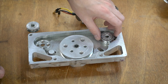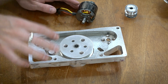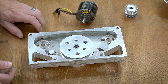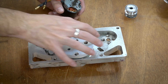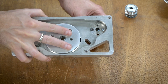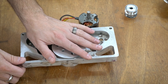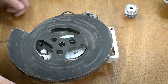The next issue: I only fix what's a problem — that's always my code. I'm not going to touch anything that doesn't need to be fixed. These are only things that need to be fixed. The motors attach with four holes — one, two, three, four on each side — and sit underneath like that. The biggest issue is this weapon block sees an insane amount of force: this thing is spinning at like 8,000 RPM.